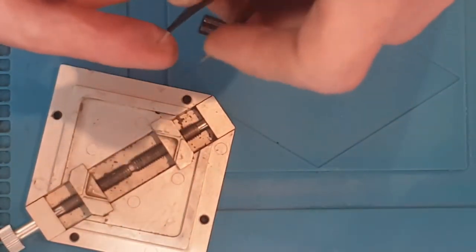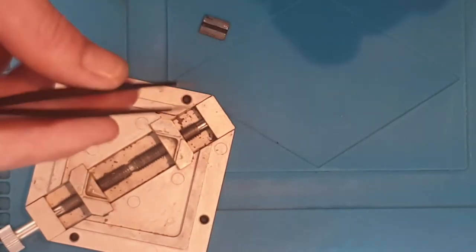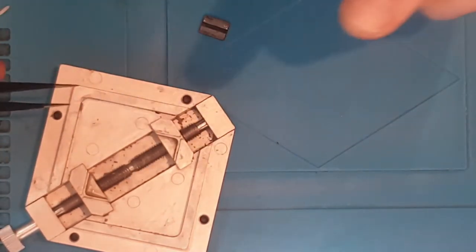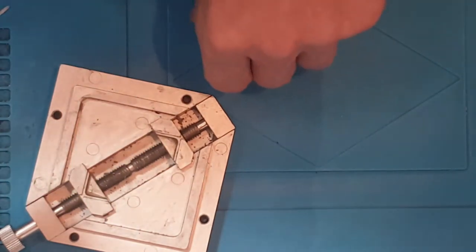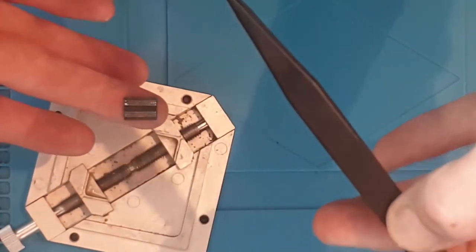And I believe it was Louis Rossmann I saw do this a couple of months ago on a video. It was actually an older video of his, a few years old, where he was reballing a chip and the chip itself had a couple of missing balls, and he was placing them by hand using hot air. So that's one way you could do it. You could sit there and place every one by hand and solder them individually, one at a time, if you really wanted to. It's going to take you a lot longer, especially when you're working with something like a PlayStation 4 Southbridge, which has